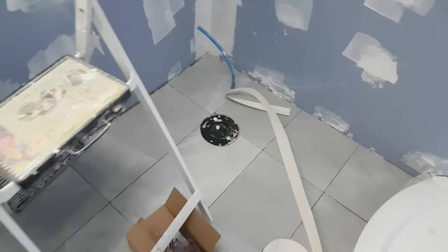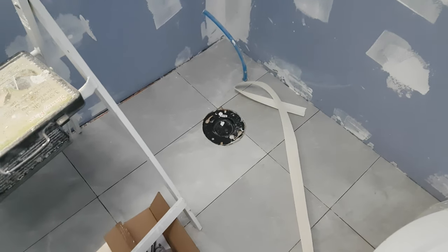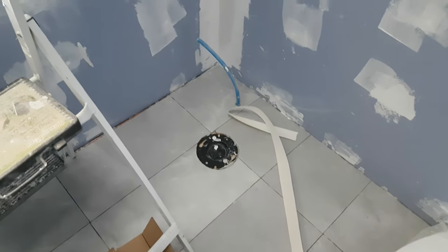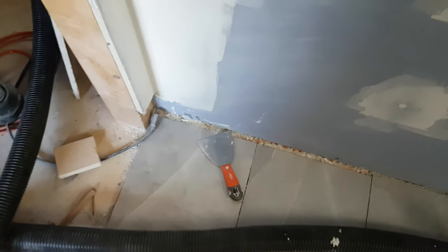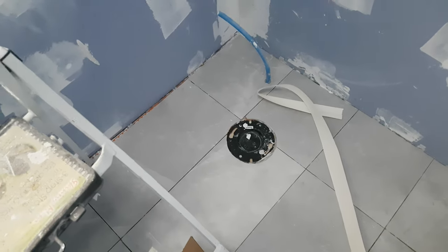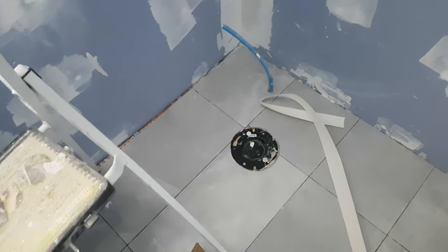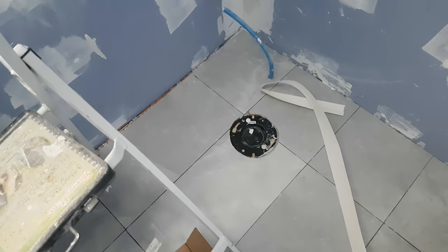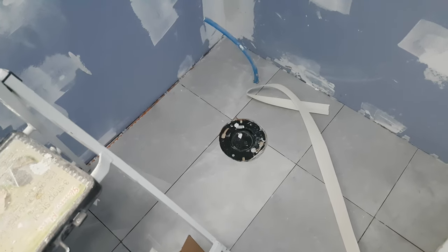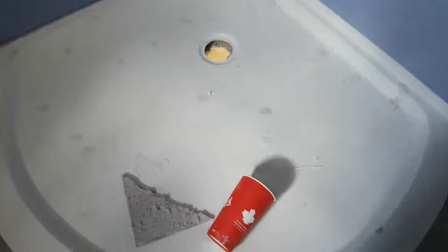Back to the scraping — I finished off as much mud as I can do today and have to wait for this coat to solidify. So I grabbed the appropriate tool and started scraping off the mortar — the thinset I used to put the tiles down. I was elated when it came up really easily. At first I assumed that was because of the porcelain's glossy glazed surface — not porous, so there's nothing for the mortar to grab onto and it just flicked off.